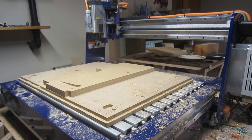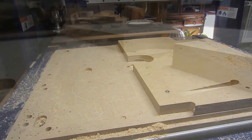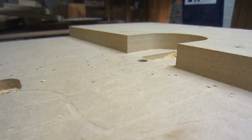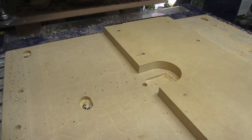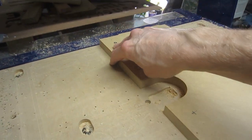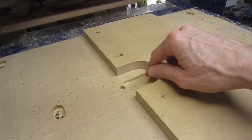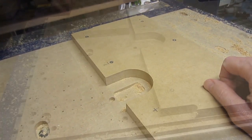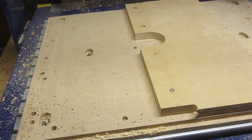In this case, I decided to use my CNC like a traditional non-CNC router table. It's possible to perform a number of basic router table tasks just by adding a fence. Unlike the adjustable fences on most traditional router tables, this is a simple, fixed, continuous fence — nothing more than a straight edge, running along the y-axis of the workspace, with an offset near the middle in which the router is positioned. I had some scrapped 3/4 inch MDF lying around, so that's the material I ended up using.